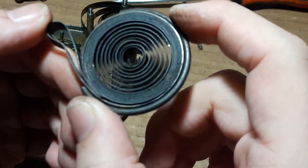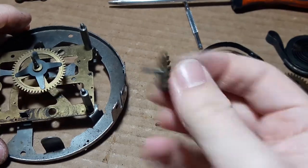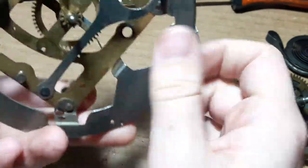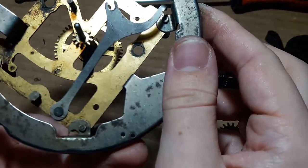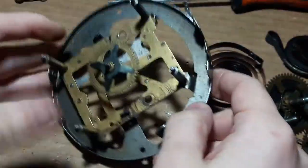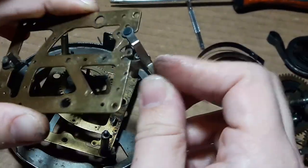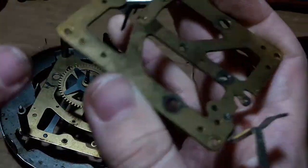There's not much I can do about this spring in the state that it's in — I'll think of something at some point. It's the stuff between the plates here that really needs cleaning. There's some dirt everywhere. I think there's nothing else to take off. I'm not going to bother with the center wheel because I can get around it and clean around it, and I don't want to risk damaging that cannon pinion and losing tension on it or breaking a tooth off or something. So I'll leave this here and clean it up off camera as usual — basically just scrubbing each part by hand with a little piece of sponge, a cloth, and alcohol.